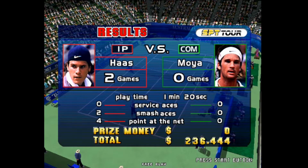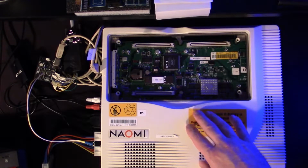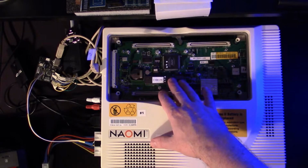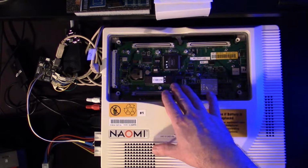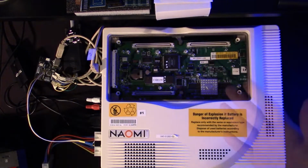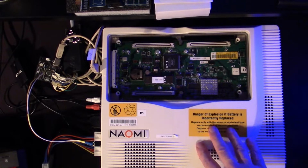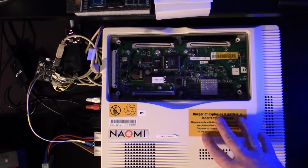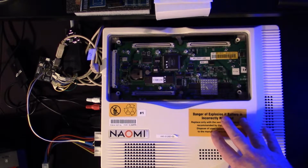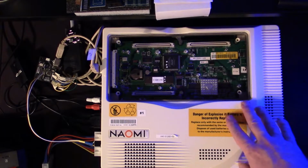So folks, just to finish things off, I got the top 3000 out and wrote some EPROMs using the multi-region BIOS. So it's controlled with dip switches here at the back. It's the H revision, which is the latest BIOS. So this unit, or both units now, should work no problem with a GD-ROM setup or with the NetDIMM setup, and with almost 99% of the catalogue as well.